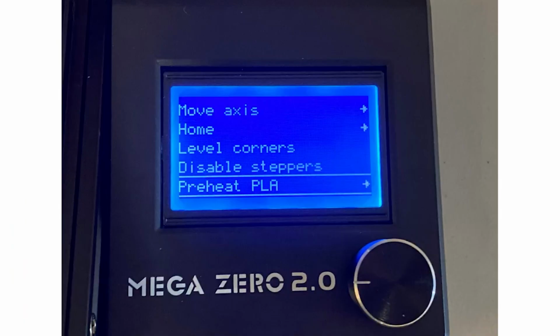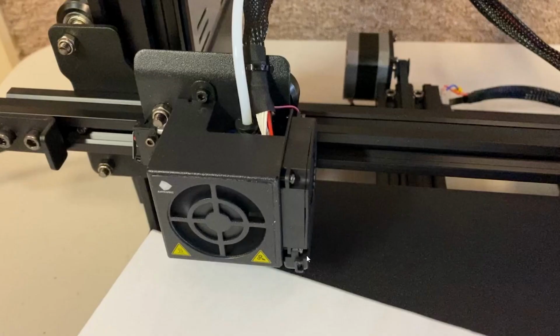It's in the manual. It's very easy, but it steps around the corners for you, and you're just able to adjust the knobs underneath. I will say, compared to some other printers that I've used, it works best when it's very low to the surface, at least with this magnetic plate on. I make it tighter than I normally would. So I can move the paper out, but it's dragging quite a bit, and that seems to have worked better for me overall with the printing process.